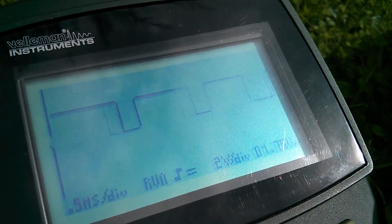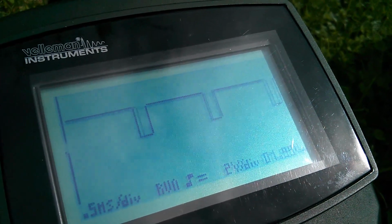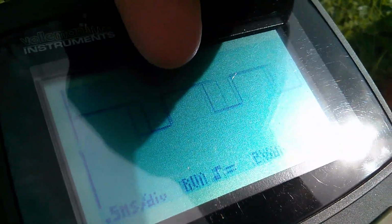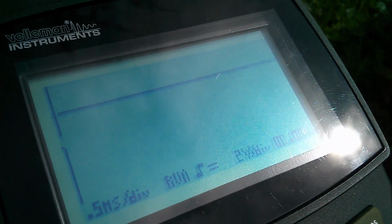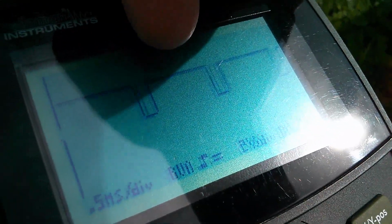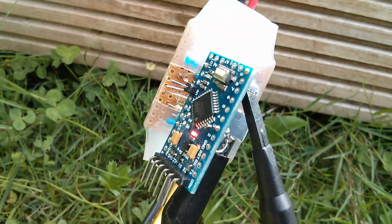Now on the PWM5 I was able to synchronize those because there was an interrupt source from the PWM hardware, and I was able to use that to trigger the ADC reads. So it would read in the same place in the PWM cycle. So for example, you've got this nice stable rising edge here. If you take a read just a fraction of a second after that, then you'd get synchronization between the reads and the pulses, and that helped prevent this jitter. Because what's happening here is that when it reads, it sometimes reads when the pulse is high, it sometimes reads when the pulse is low, and those two reads will be different values because of the current flowing in those red and black wires, and I think that's where some of this jitter is coming from.